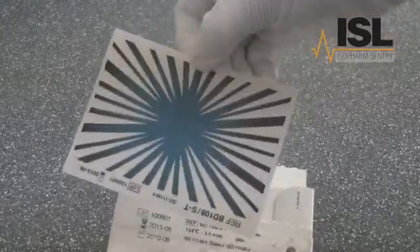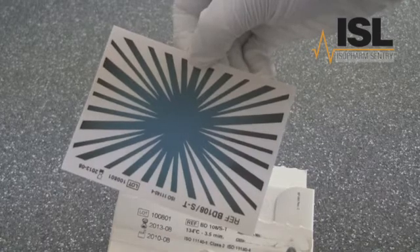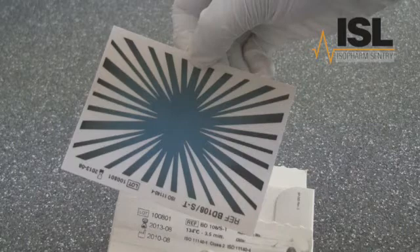In this example, the ink on the sheet still shows traces of blue. This is because there was still air in the pack when the steam was pushed into the chamber. The air in the pack prevented steam from contacting the area of the sheet that remains blue. In this instance, the cycle has failed.